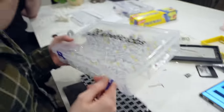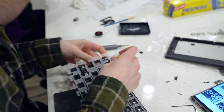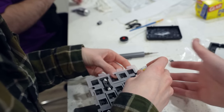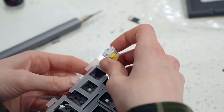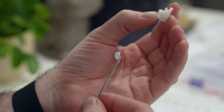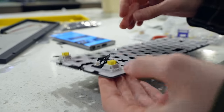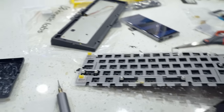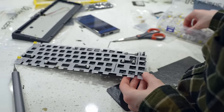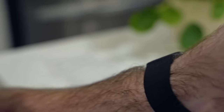What color are they? Yellow — just like the board. When you put switches into a board for the first time, you're going to want to support the PCB from the back. Hold the back of the hot swap socket as you put the switch in. That's really important for beginners because you might push too hard. Toby, that's so much lube on those stabilizers. It'll work. It'll work. It'll work. Now Josie has put in her first and second switch, starting at the corners and working her way in — this makes it easier without having your plate warp.